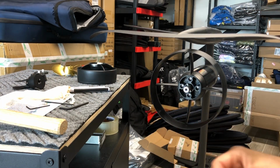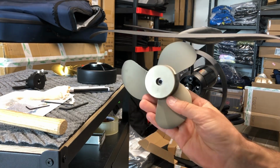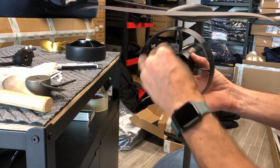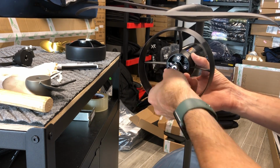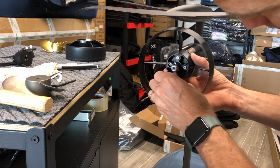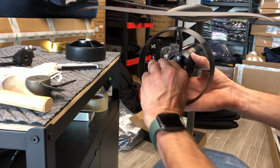And there's no corrosion or anything. It was just a little tight. That shaft has lithium grease on it, so it usually just slides right off. This one was tight for some reason. So we got that off. We're going to take the four retaining bolts that go into the shroud spacer off, undo all those, and then remove the shroud right off of the shaft.